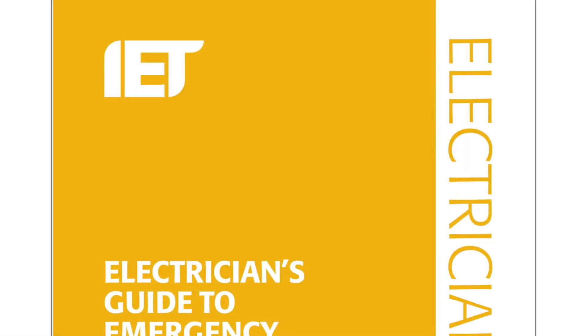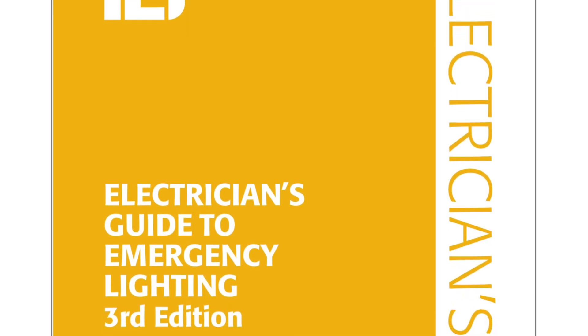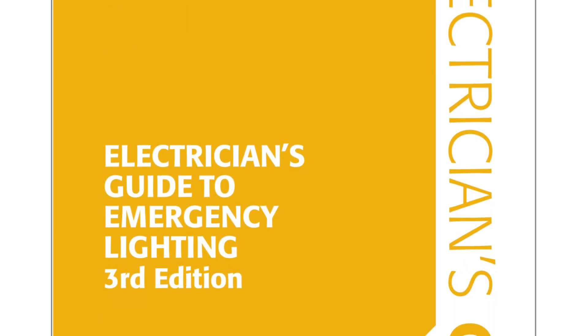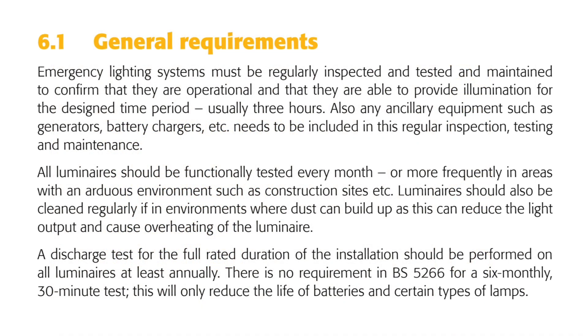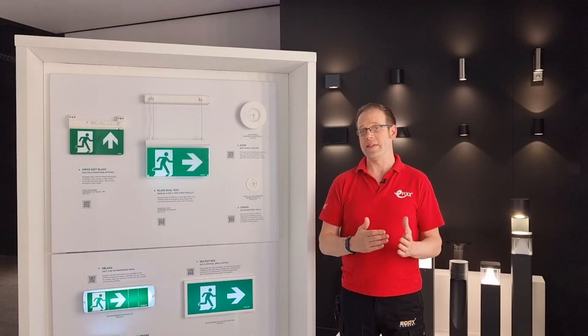The electrician's guide to emergency lighting actually calls attention to this and explains clearly why it's no longer required, in chapter six on operation and maintenance. It states really clearly: there is no requirement in BS 5266 for a six-monthly 30-minute test. This will only reduce the life of batteries and certain types of lamps. So it's not required and could actually reduce the longevity of the installed fittings.